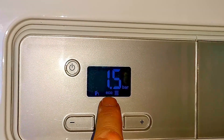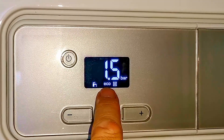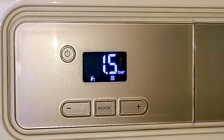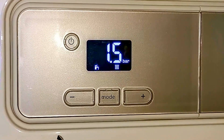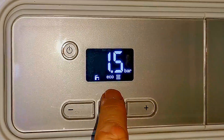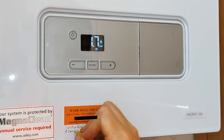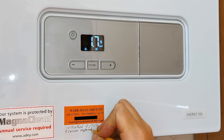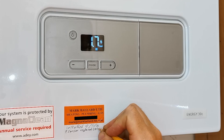One last tip: if you want to know how to turn on your eco setting - that's the setting that stops the boiler from firing up all through the day and night keeping itself warm when you're not using it - that's inefficient and adds extra wear to your boiler. If you want to know how to turn that setting on and off, click on the link above or in the description. Back to this boiler, it's all working fine now. I'm just writing a quick note on my label saying when the pressure sensor was changed - it's always a good idea to make notes of when things are done.